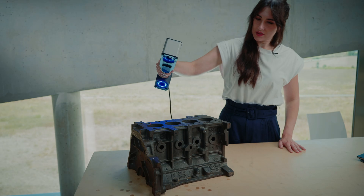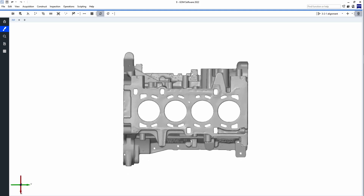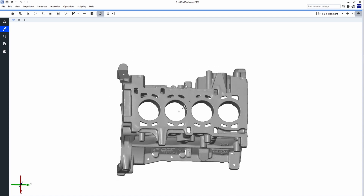As a rule of thumb, you can work with three times the diameter of the hole you want to scan. If you have a look at the scan data here, which I created for the general settings, you see that we did not reach too far inside the deep pockets. So now, I can use this single laser line to scan deeper inside of the pocket and capture a lot more data.